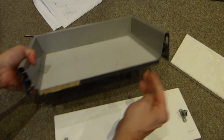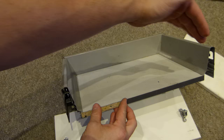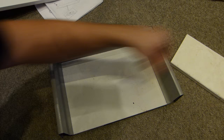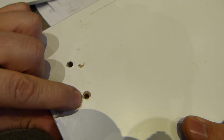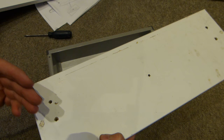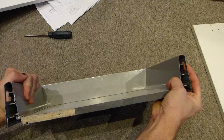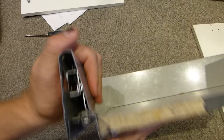And from latch center to latch center, this is what was the number? I wrote it somewhere here. It is 387 millimeters. This is metric hardware, you have to go metric. The size of these holes, this is a 5 millimeter drill bit. And of course, 15 and a quarter inches is going to be close enough this way, and an inch and a quarter is kind of close enough this way, and whatever fractional drill bit is close enough to 5 millimeters, there is enough give in the hardware, you know, it bends enough and can take up minor differences. Let's have a look inside.